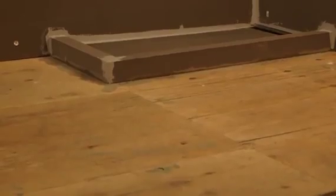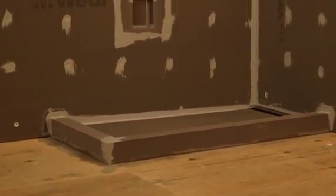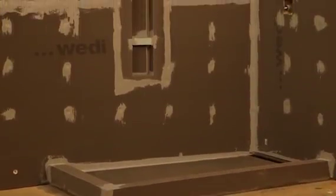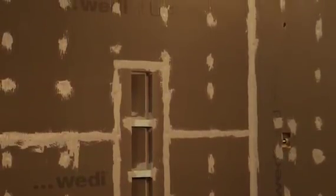You may use any tile or stone in any size, thickness, or format over WEDI shower systems. The installation can be done using any cement-based thinset mortar. On the floor, tiles smaller than 2 by 2 inches require an epoxy grout joint. Larger tiles on the floor can be used on single-slope WEDI Rialito and over 4-way slope Rialitos if grout lines or relief cuts are made to go along with the 4 WEDI slope lines.